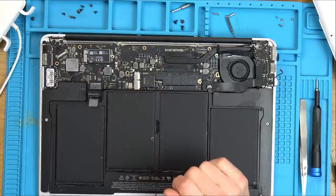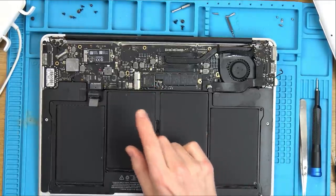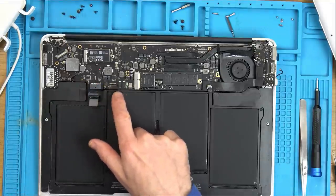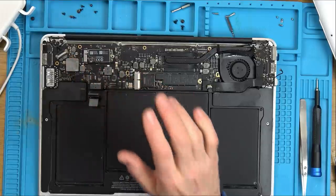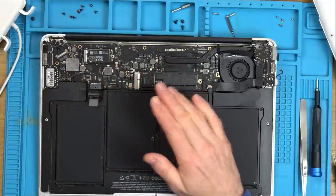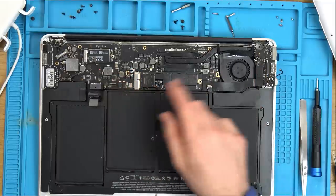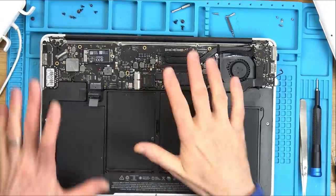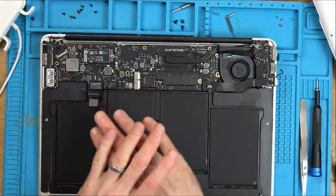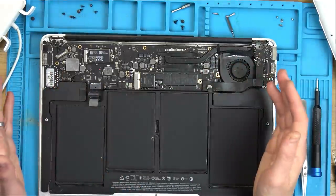Look at the damage on this board. Something came up on screen there, but there's no backlight. The thing is though, maybe one of the other cables does the backlight. Or maybe that's the problem. Maybe the backlight circuit's gone. In which case, then, it might be fixable. Maybe these chips are for... Well, actually, no. Maybe it's not charging because of the chips. But still, there's something to go on, isn't there? I thought the whole thing would be ruined. But the CPU part of it appears to be working.